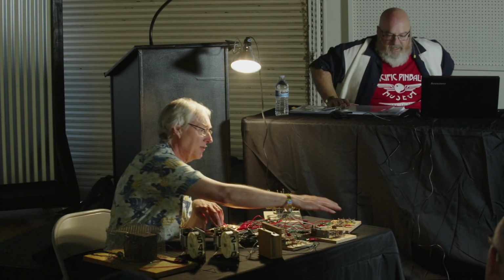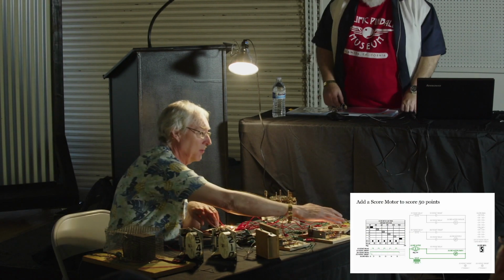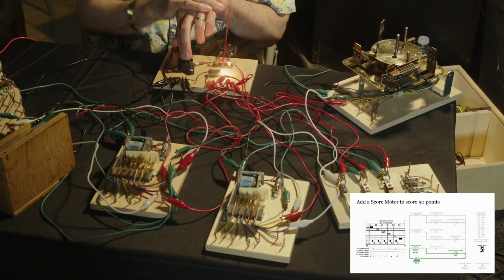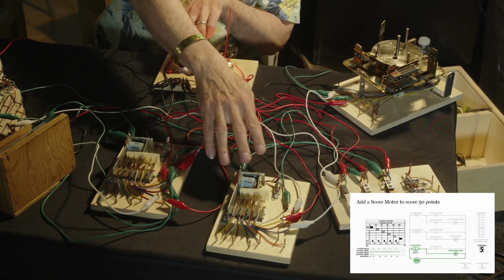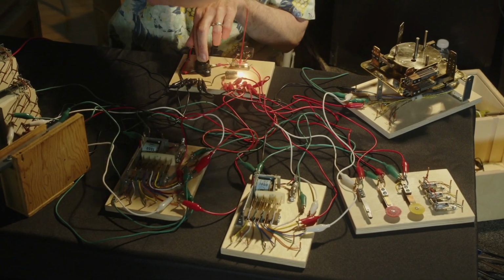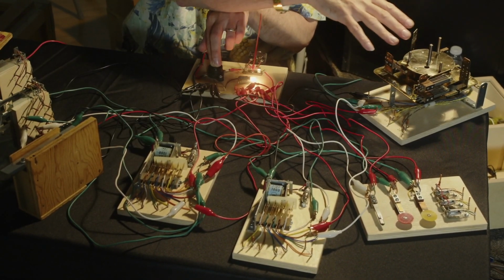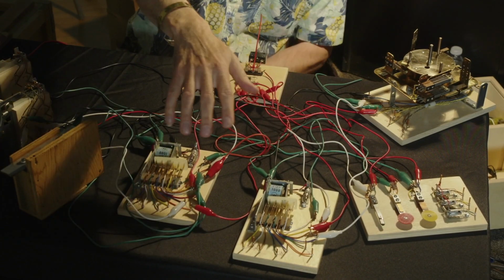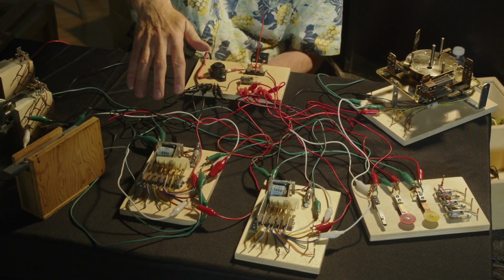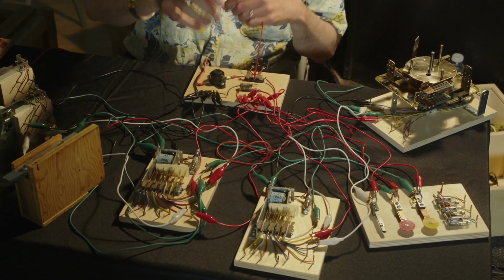I've got this 50-point relay wired up just to demonstrate that it's working, without biting off more than I can chew. So the next step is to leverage this 50-point relay and have it shut off at the very end of the process by the motor. And the other step is to now have the motor drive our 10-point relay, right? Sending 5 pulses to my 10-point relay.